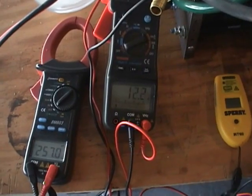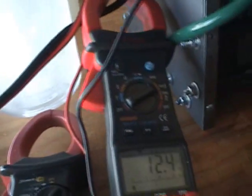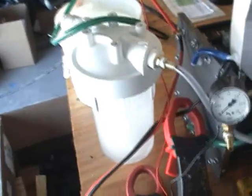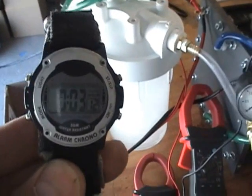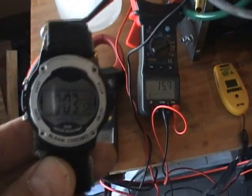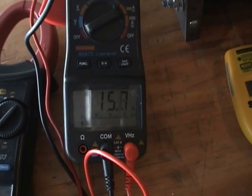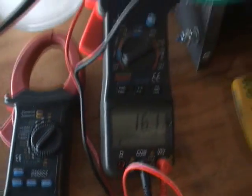I think I'm really close now — about 12.5, 12.6 amps. It can be 20 liters a minute. I'm going to run another test at 12.5 amps. I've now just done it: 3.12 seconds for one liter. My amperage is just jumping everywhere — it was at 13 amps, now it just jumped to 15. 260 volts. So it's a little over 20 liters a minute now.